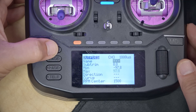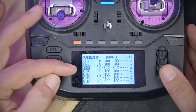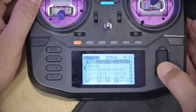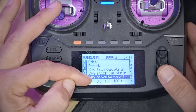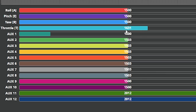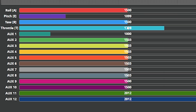Back out, then with channel 3 still selected, long-press the jog wheel and choose 'Copy min-max to all.' This copies those corrected endpoints to all other channels, so the yaw, pitch, and roll channels all now span 1000 to 2000. Our endpoints are correct.